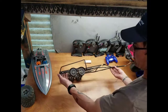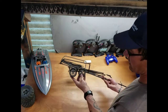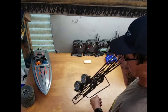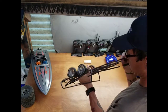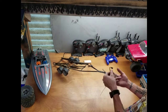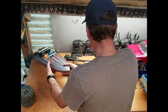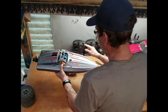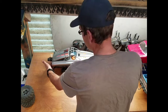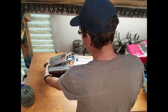This trailer I built out of round metal stock, a couple of sections of pipe for the fenders, all-thread axles with no hexes, and brake line tubing on a walking beam suspension system — works fine, real simple. It has working crank LED tail lights, and those are modified windshield wiper blades for boat guides at the front. The trailer is all steel, which makes it very easy to drive the boat right up on and very secure for trailing to and from the river.